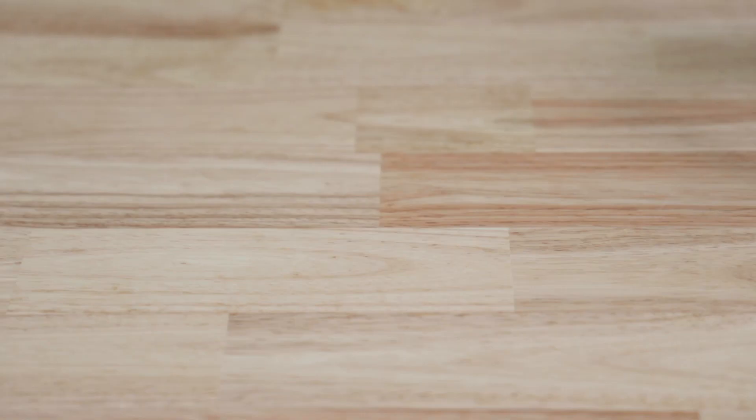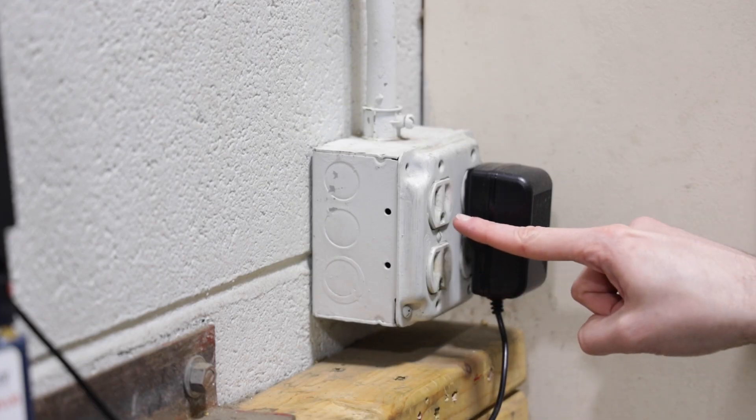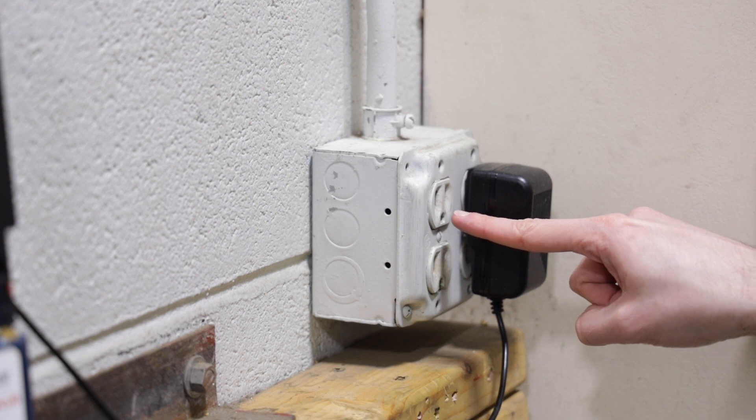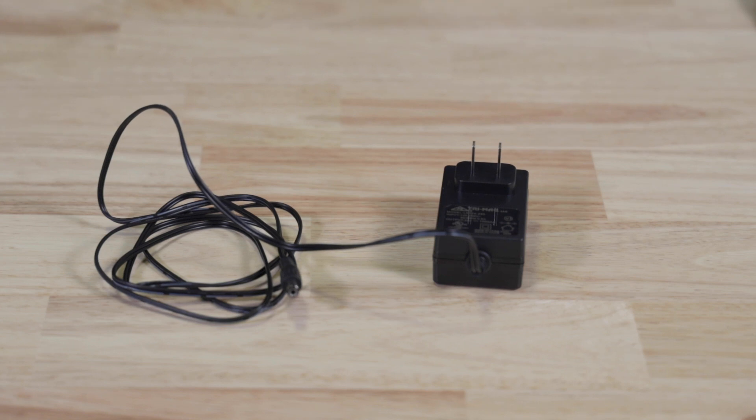Installation instructions and other supporting documents are included to help you along. Now let's mount the flow sensors to the piping. The only tools you'll need are a Phillips head screwdriver, the pipe measurement kit that was included in the welcome pack, and perhaps a measuring tape to check mounting clearances. The flow sensors connect to the sensor module with a 10-foot or 30-foot cable. The sensor module requires constant power from a standard 110-volt AC electrical outlet. Each sensor module has a 4-foot power cord, so plan accordingly or arrange for power to be installed at the preferred location.